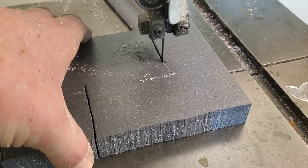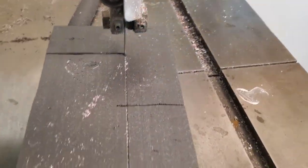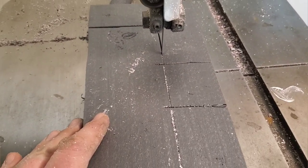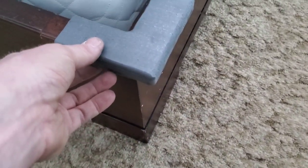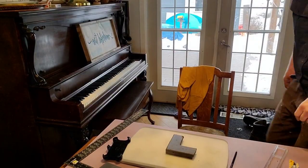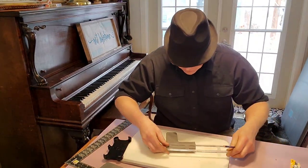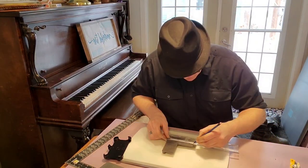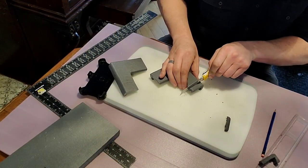This project all starts with some high density foam — in this case it's black, but in most cases it's either blue or pink where I live. I was careful not to get bogged down with trying to use hot wires to cut the foam; although it is a cool process, it's not really necessary. For this one I just used a router to round the corners and to cut the recess you're seeing here. But the router got away on me and cut a bit of the end off where I didn't want it — pretty sure my wife won't know. Now that I'm perfecting the skill I'm spending more time on the foam product rather than the end casting.